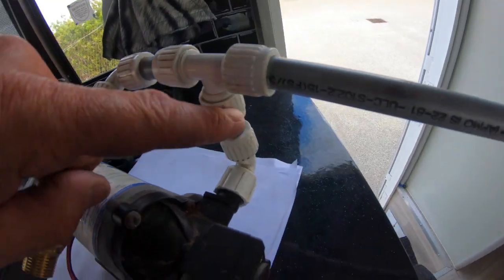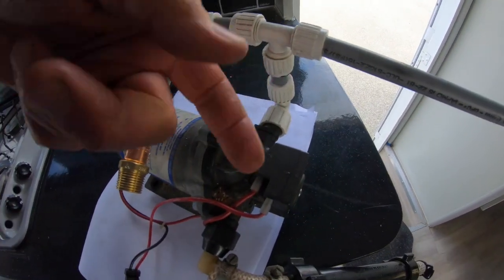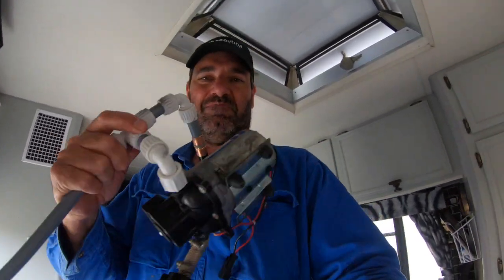Here's the gray fitting - this one came from the town water through there. And as I pointed out before, there's no check valve. So when it was connected into the mains from the caravan park, you'd have that back pressure pushing on that diaphragm all the time. I spoke to the owner - it's just a case of, look, I've got to replace this suction line for another $150 or whatever. Do you want to put a new pump in while I'm there? I've still got to remove the old pump anyway, and it only takes another 15 minutes to whack a new pump on there. He said yeah, go ahead - and then we can just get rid of all this gray pipe as well.